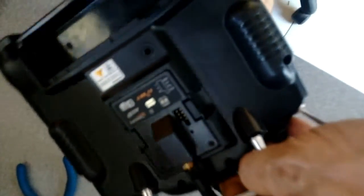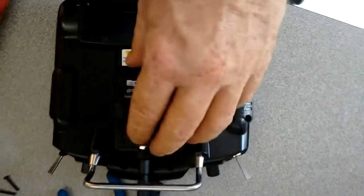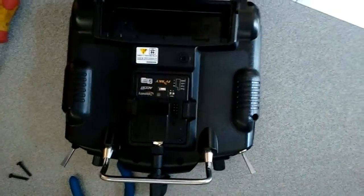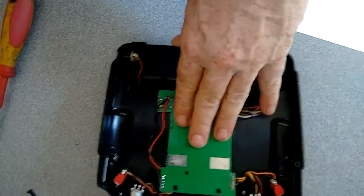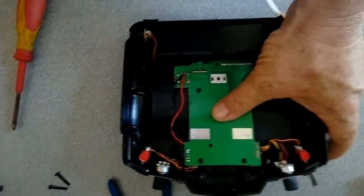The one thing I did do — just a little bit of an engineering tip when you're putting things together like this again. Just leave the screws in the PCB, tighten it down when you put it back in without the module. Then back them off a couple of turns so that plate can actually move under the screws. Try and sit it central, then set your unit in. As it clicks in it'll want to sit in the middle — that PCB will want to sit in the middle on the back. Turn it over and give the PCB a little bit of a push around with your fingers. If you can feel that it's centred under the screws, tighten the screws back down.